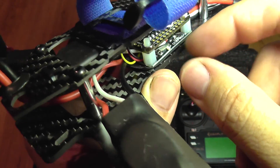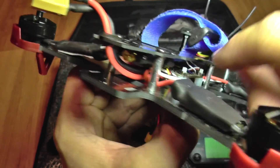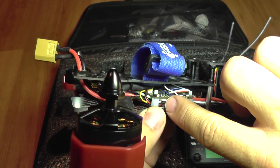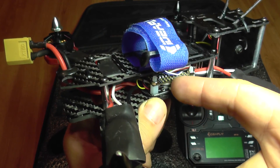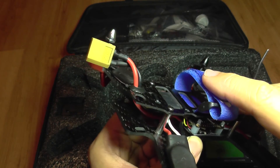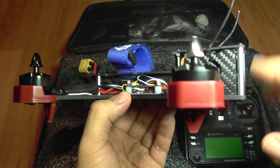It has a control switch for turning on or off the video transmitter, which is also installed here. You should take note that mine came with this powered on — powered on it's this way. If you start it without an antenna, you may burn the transmitter, so take care with that.